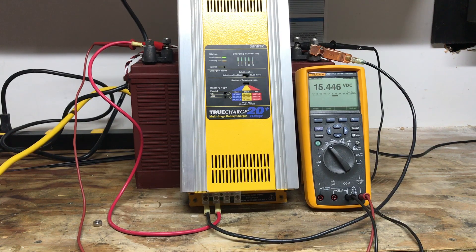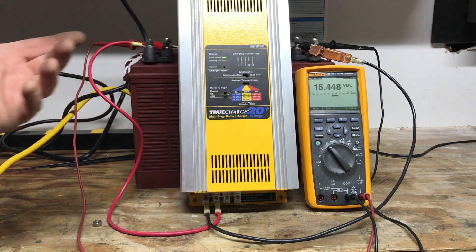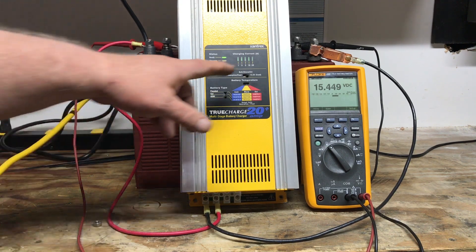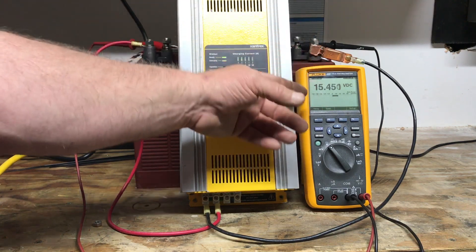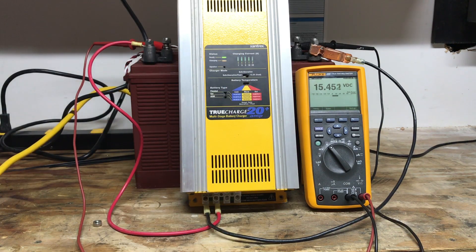I hope this helps and puts into perspective some of the failures you can see out there. This battery charger should not be continually pushing this battery upward — it's still taking 20 amps, because that's what happens when you equalize a battery: as we increase the voltage, the battery takes more and more current. Eventually the current would drop down a bit, but this is just going to keep going up. And if it keeps going up, that's never going to drop — not until the battery fails. Right now it's battery charger against battery, and if this keeps up indefinitely, guess which one loses? The battery.